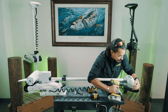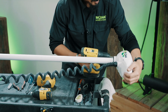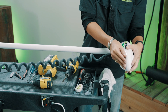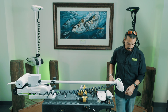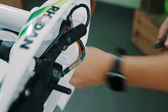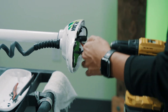The first step is to take out the four screws in the hood — just four up here. Then get your side cutters and undo your connections here, cutting away the zip ties. You're also going to cut away the heat shrink just to make it a little easier.